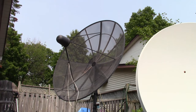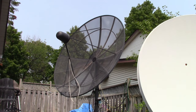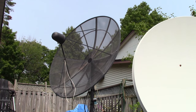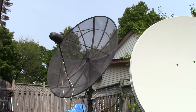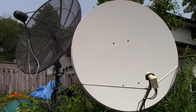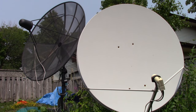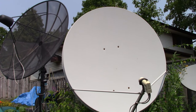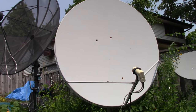The big part of the hobby is getting what you can for free without paying monthly fees. C-band satellite dishes differ from direct-to-home service satellites because C-band uses a different frequency with a larger wavelength, which requires a larger dish. For the most part, you're not able to get C-band on a smaller dish. This four-foot dish here — I have picked up C-band frequencies on it, but not as reliably as the larger dish. I currently have a KU band LNB on it to pick up weaker KU band frequencies.